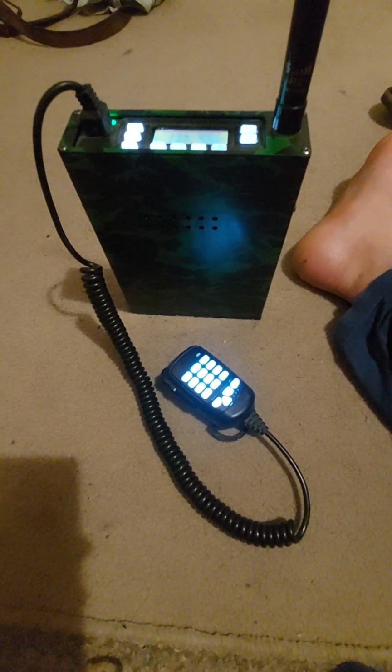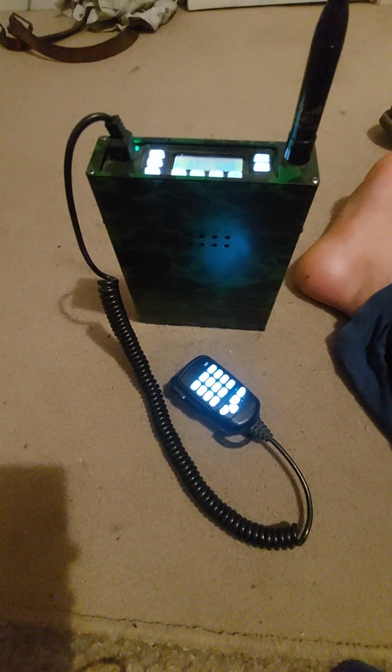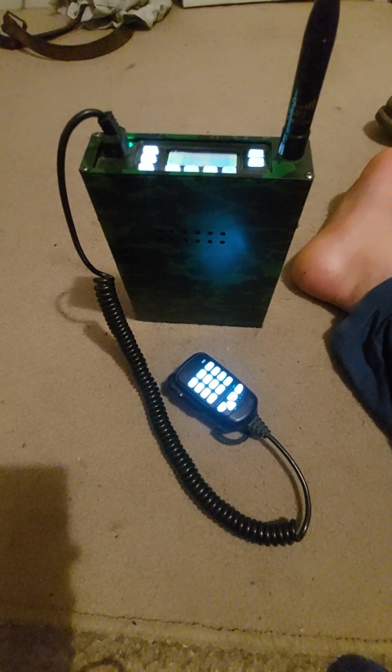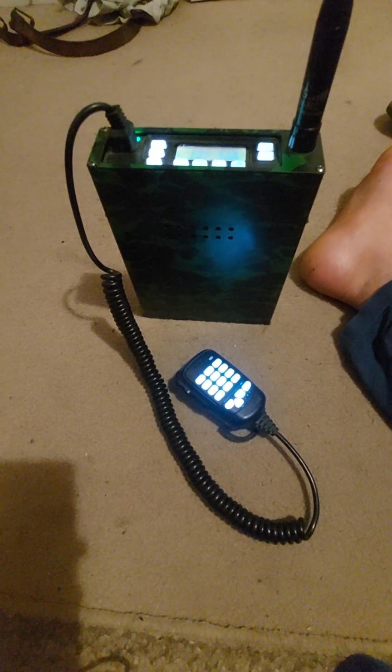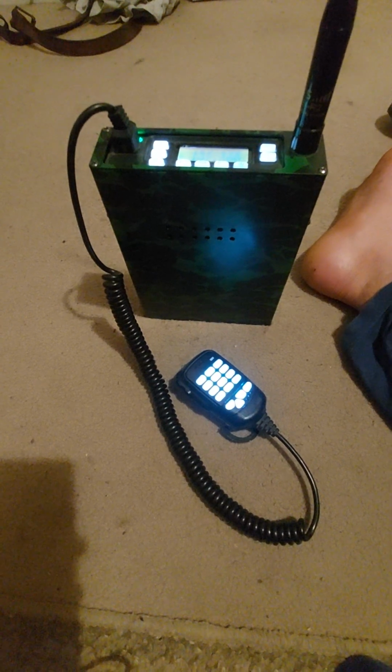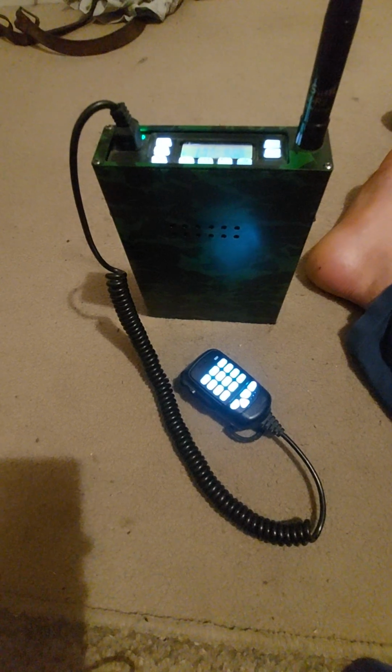higher bands. They'll do nothing for you on 40 and 80 and 160 except help the antenna couple better to your radio. That's all they will do. But on the higher bands, having those counterpoise wires is effective for directionality. I don't recommend using an inverted L as a beam, okay, because it's kind of silly, but it does have gain, and it is remarkable once you put that antenna together and use that specific geometry.